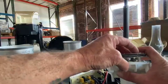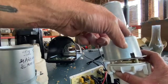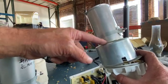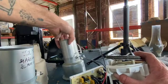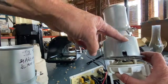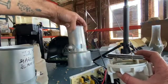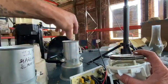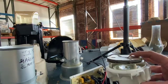So what I was trying to do with prototypes was to have a thermocouple right above this lip in order to be measuring bean temperature, and then one down below in the heat input area — so right in this area. That was the one that's a little tricky because you don't want to be contacting your heating coil or anything dumb like that. And sticking something in there does affect the airflow, so you have to be mindful of that.